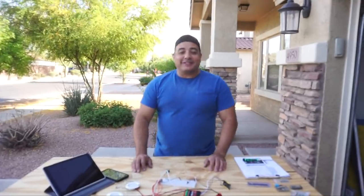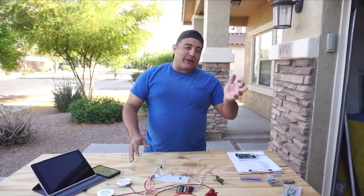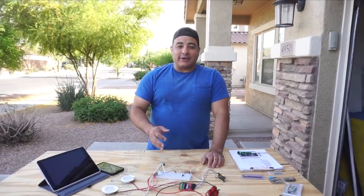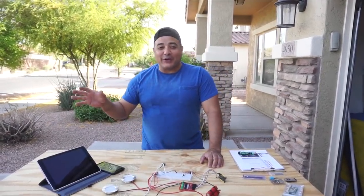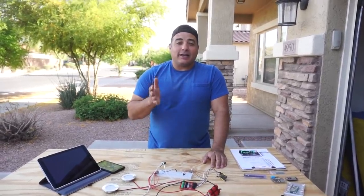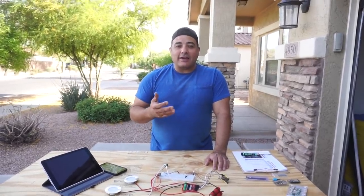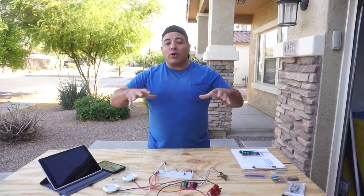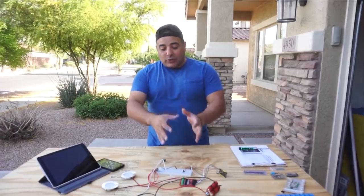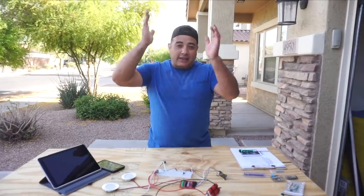All right, so what happens if everything goes down? In other words, there's no network, or there is a network, but the processor goes down. What happens if one of these processors goes down? Hopefully I'll have the code locally and I can just load it on another processor, plug it in, and we're good to go. But if we still need to turn lights on and there's just no way, we're going to have switches that are more of a manual type switch. They won't be as granular as these, where you can control the different zones. It will literally divide the bus into three.